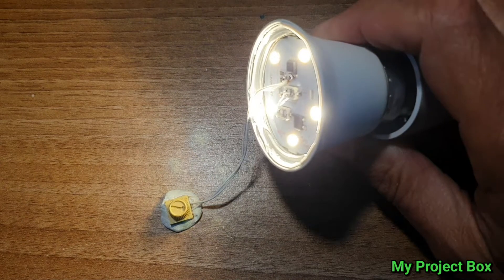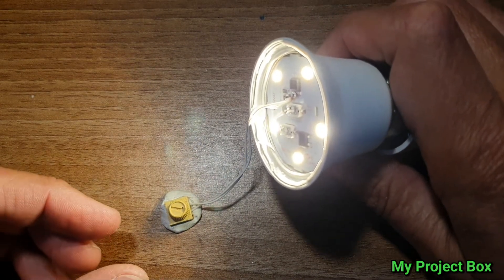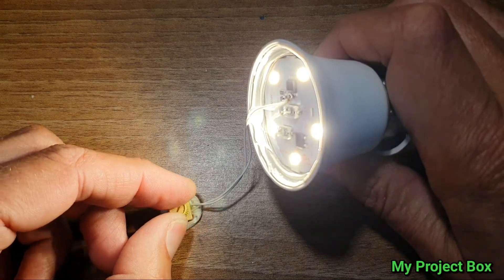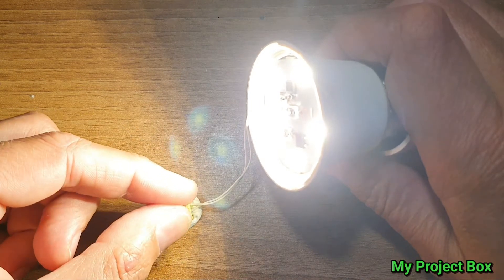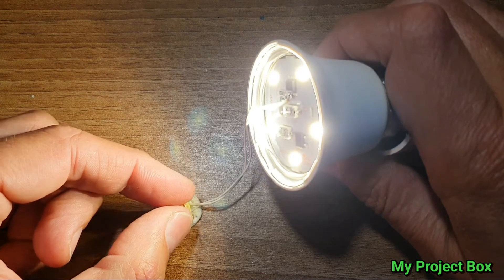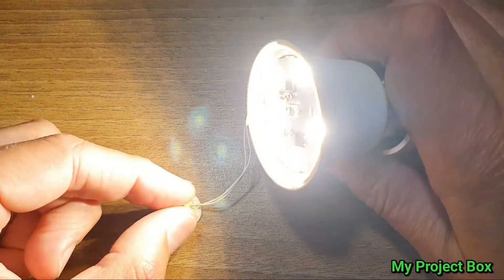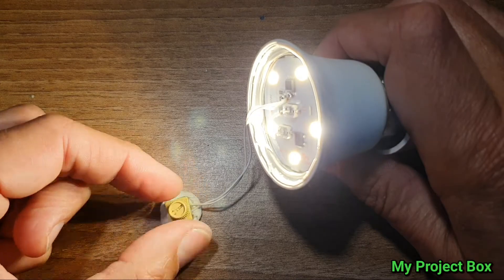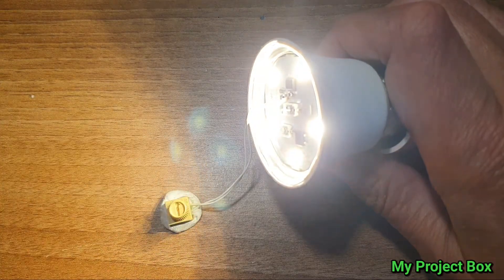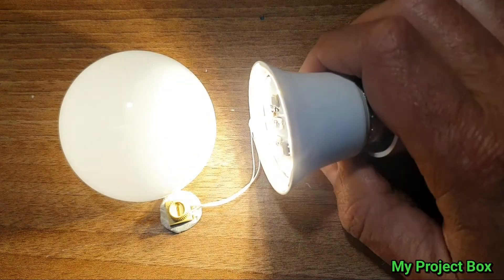All right, so I think we should just carefully test it now and see if that works. I've locked the exposure so that the camera doesn't compensate for the difference in brightness. If I turn the knob you can actually see it now — it swamps the camera on maximum brightness and you get a fair amount of control. So it gives you some usable dimming control, which is quite fun really. And if we can build that into the dome of the bulb, we've got a bulb with a built-in dimmer — a bit of a novelty but fun anyway.